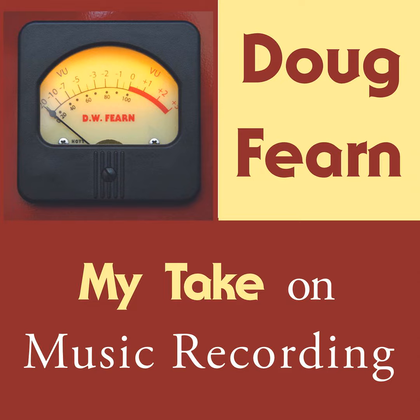Noise from tape was always a problem. The best you could expect from the machines of that era was about 65 dB of usable dynamic range. Ray Dolby came up with an ingenious solution in the 1960s — the first product of Dolby Labs. It was a noise reduction system that improved the signal-to-noise ratio by at least 10 dB, and it was actually better than that subjectively because it was very effective at reducing tape hiss. But the Dolby units were expensive — each channel needed its own one rack space unit. I could only afford a pair of them for the two-track master machine at that point. There was still noise from the 8-track, but that noise could be minimized during the mix by pulling down the fader of any track that did not have audio on it. With 8 tracks, it was usually possible for one person to manage the faders, and that kept the noise at an acceptable level.